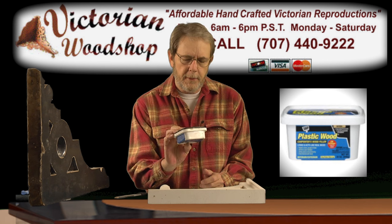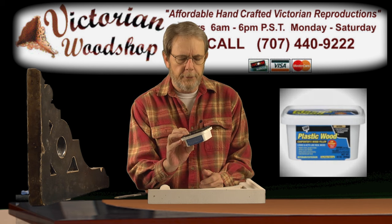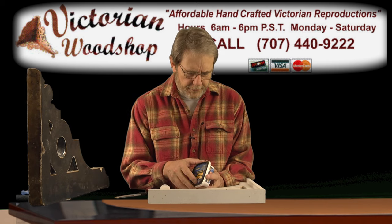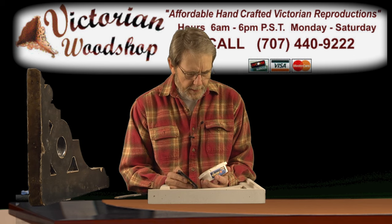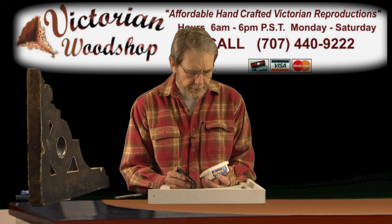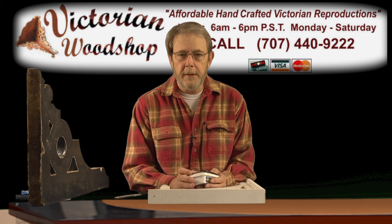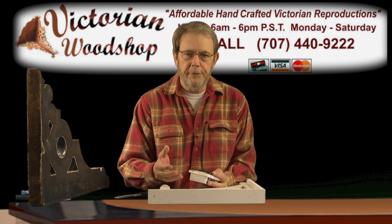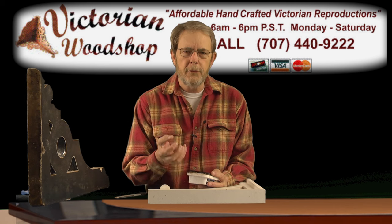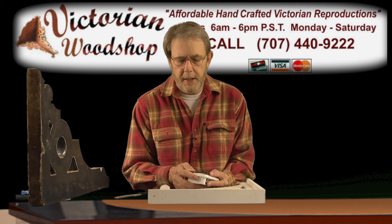Something that has changed in the way of wood filler is they have gone to a plastic-based wood filler. The product I'm holding right now is made by DAP — D-A-P. You can find it in pretty much any hardware store or any big box retailer, and it says right on the box 'Plastic Wood.' It's got a more creamy texture. I wasn't real sure about it until I started using it and gave it some really good experimentation. But this is one of the products I'm going to recommend. It dries well, it sands great, it's less gritty than the old wood fillers, a little more liquidy than what we're used to — but that's okay because it dries quickly. It's just a better product, I have to admit.